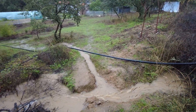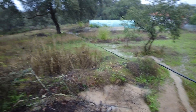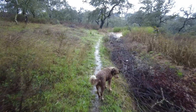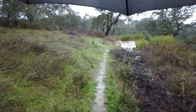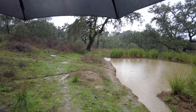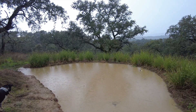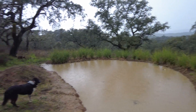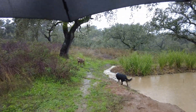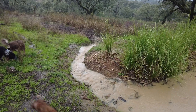I already divide the water into two: the upper flow goes to the pond and the lower flow to all the swales. The water here in the pond is slowly using the spillway, but I see there's a lot of sagging that took place over there. That's not a good idea — I will have to make that higher in summer, or I have to lower the spillway.